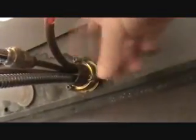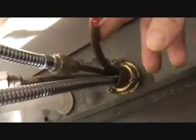Everything you pretty much have to do down here below. Okay, so I'm going to get my wrenches and undo these nuts. Now, if these nuts don't come off just by turning that, usually the copper line there has a nut head on that, and you can kind of hang on to that as you're turning that. So you may need 2 wrenches down here, a pair of pliers and a wrench, whatever. Okay, I'm not too concerned about twisting these because these are the bad ones. This sink faucet's going to be replaced, but let's get her going, shall we?